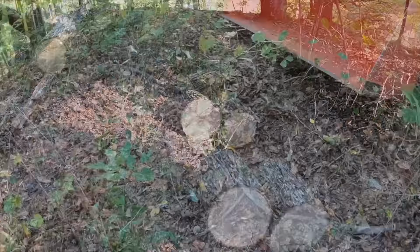So one more thing before we wrap up this video, just to get our fireplace and chimney ready for this year. Our next task is to check this chimney out, make sure it doesn't have a ton of creosote or anything like that in it, and we'll take the brush and brush it out some, just to loosen up that junk and get it cleaner for the winter. It's got some in it, but doesn't look too bad. Let me show y'all. Actually, it's looking kind of rough. We're going to scrub this out and see if we can get it better. That could definitely start a little chimney fire right there.